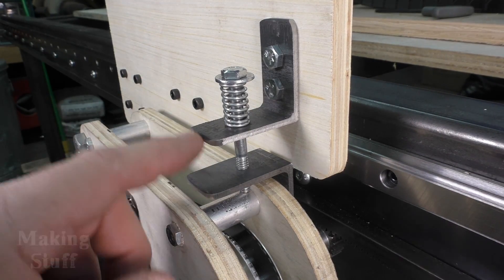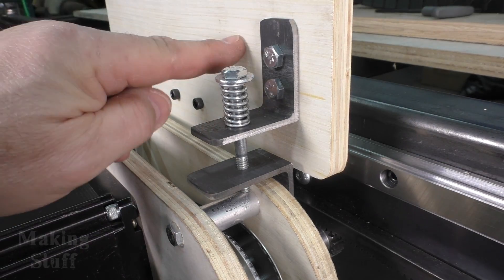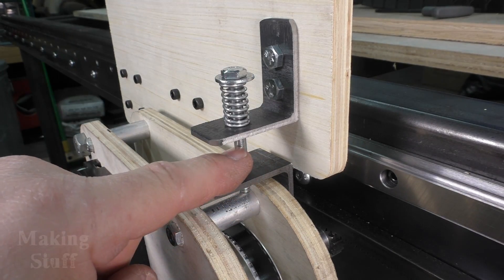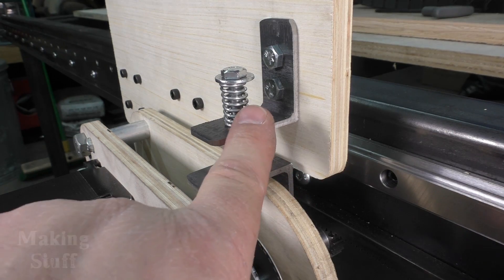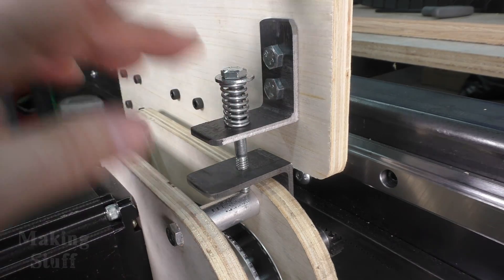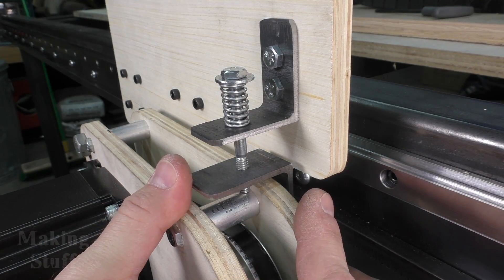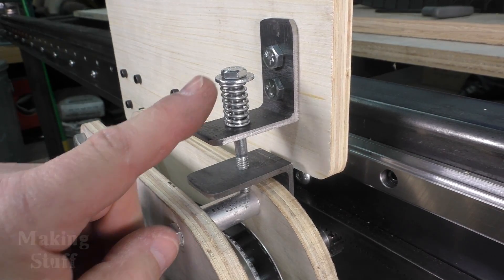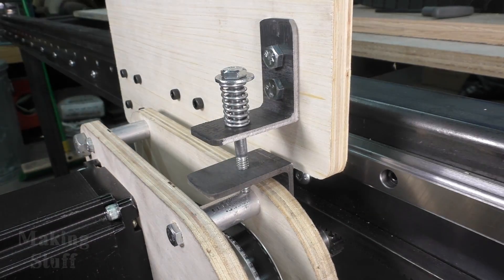After a little trial and error, here's what I came up with: two L brackets — one mounted to the test plate, one mounted to the drive reduction system — held together with a quarter-inch bolt. One bracket is drilled and tapped, the other is just drilled, and there's a spring captured with a washer on top. This allows a little bit of give in the system if needed, and I can also adjust the spring tension just by turning the bolt. What do you guys think of the build so far? Is there anything you'd do differently? Let me know in the comments below — I still read all the comments on my videos.